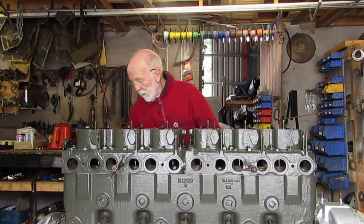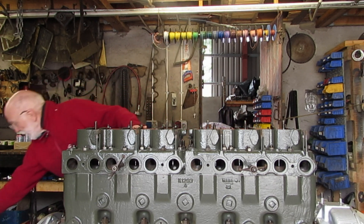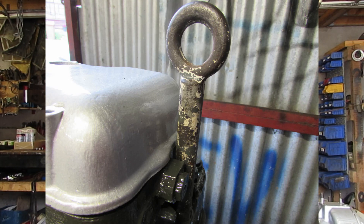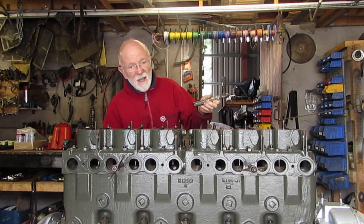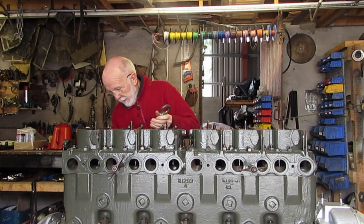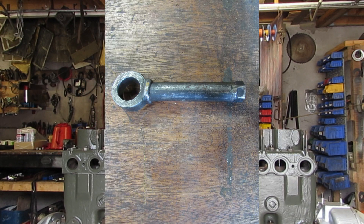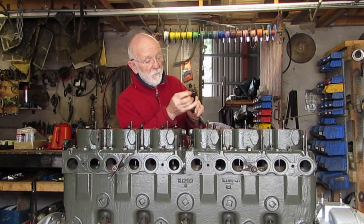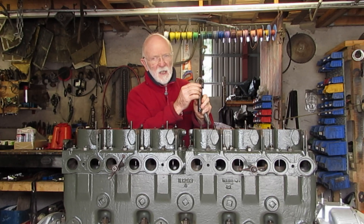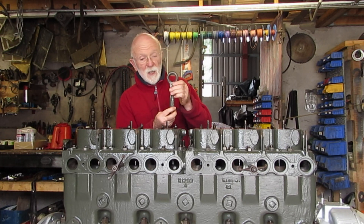This gives us some flexibility — we can put on our lifting eyes. There's a conventional original Gardner lifting eye; it's threaded for about an inch and screwed on there, giving us a really very strong connection. That's a homemade lifting eye — still pretty good, just a conventional half-inch BSF nut welded onto heavy gauge tubing with a heavy gauge ring weld at the top. It's fine, but I have a slight preference for the original ones. They also look better. My understanding is that each engine as delivered by Gardner had two lifting eyes supplied with it.